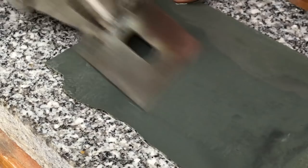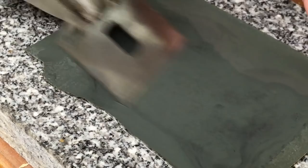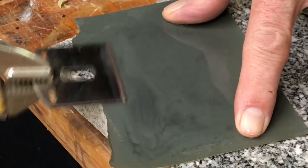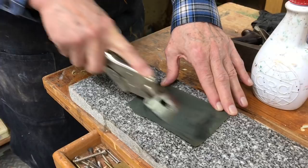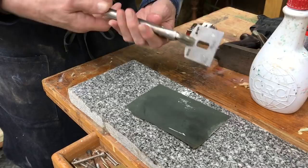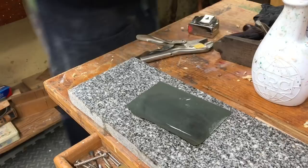You don't have to use granite, but I was lucky enough to get it. You can also buy a piece of granite like this at Woodcraft Supply — they sell pieces for this purpose. This is a spokeshave blade, so I put a pair of vise grips on it. Just take off any little burr. 2,000 is probably too fine. Would you do one of your chisels the same way? Yes, but with coarser paper.